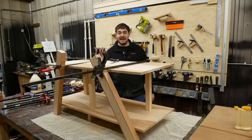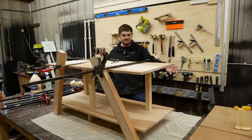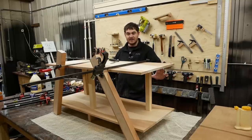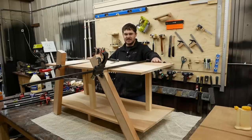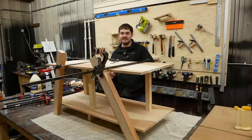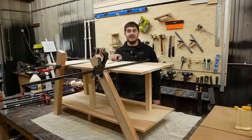This is what designing on the fly looks like — I don't need no stinking computer sketches. I've just got everything blocked and clamped up in place so I can visualize it and go from there. I've got the slabs blocked up to the height I want — I think it's about 20 inches — and I've got two of the legs clamped on so I can get the angle visualized. I've set the angle on this bevel gauge and I'm ready to make some cuts.